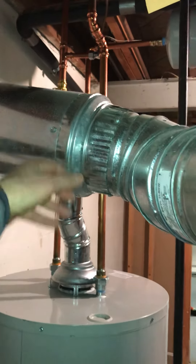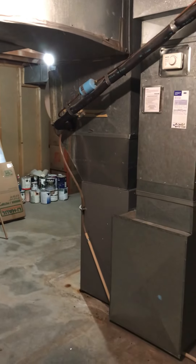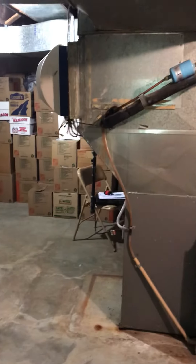There's a water heater on the back side — we actually put that in — so we'll be teeing off from back here. Looking at the back side, this is the return drop which is massive. I'm thinking we'll slice off up here, new return drop, new media filter. We get to do the AC at the same time, which is what I'm going to recommend.